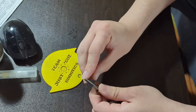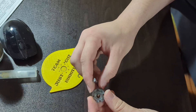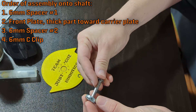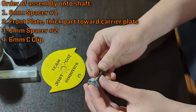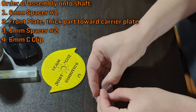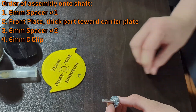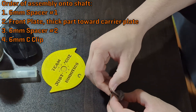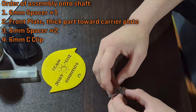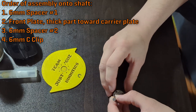What you need to do is very simple: take one shim and put it on the shaft. Then, with the notched side of the front plate facing towards the end of the shaft, slide that into place. The bearings might try to pop out on you, but that's okay — just make sure the bearings go all the way down. Then put on the other shim. Once the second shim is on, make sure it seats fully and doesn't get stuck in the groove.